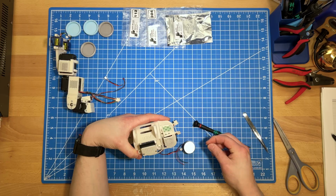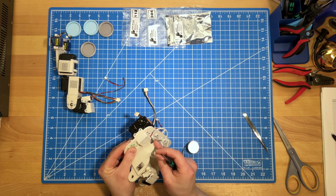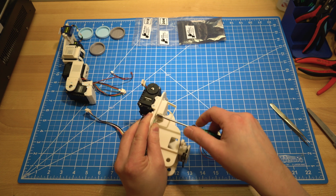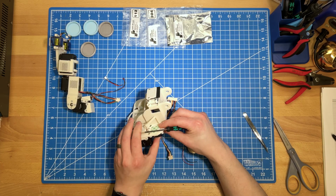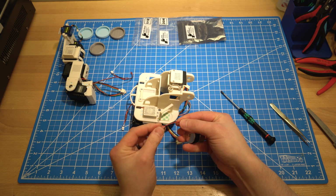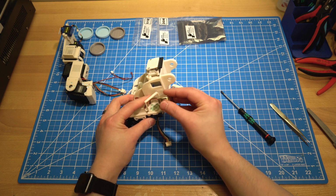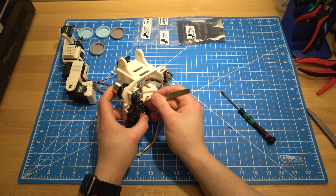And I'll take one of these screws and put it through one of the holes. I'm going to bring the audio amp into position where it should be. And then I'm going to bring this screw in like this through the bracket. And I'm just going to tighten that, get that started. Okay, so there we go. I'll swing this back into position where it will be oriented eventually. So now I've got it kind of tacked in place. I'm going to take my surface transducer and the two wires coming off of it. I'm going to feed them through this slot here. And then just make sure those wires come through the other side so I can use some tweezers to grab them and pull them through.